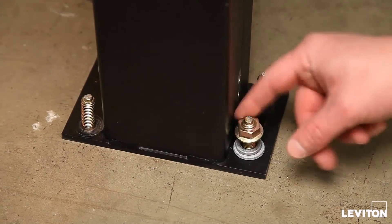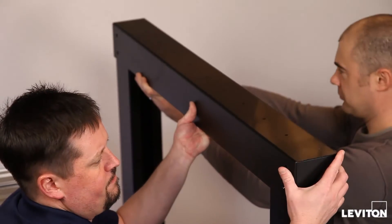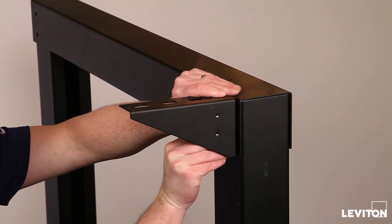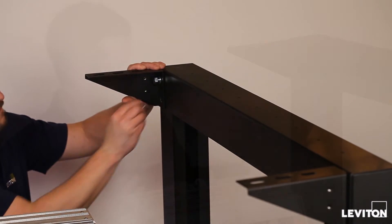The final torque will occur in a later step. Position the cross members on the top of the upright units, aligning the holes in the cross member and uprights. Add the channel attachment brackets on the appropriate sides of the cross members and uprights. Loosely secure the brackets and cross members with ½ inch 13 thread bolts, locking washers, and flat washers.